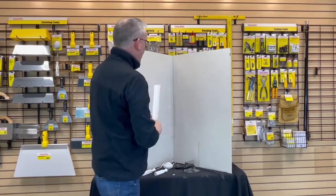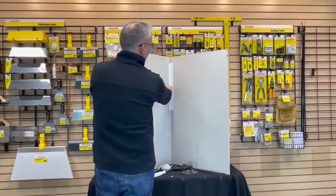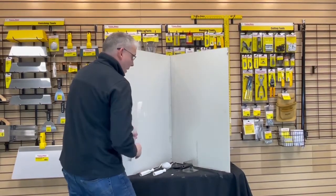You use the compound — you embed it directly in. Once you put a layer of compound up and embed it, you use a taping knife, joint knife, or an adjustable trowel and give it one pass. Let it dry, sand it, then come back and do another skin coat, and you're ready to paint.